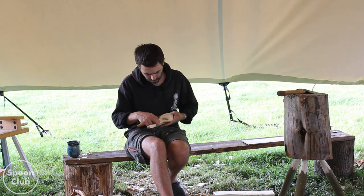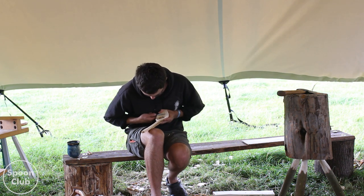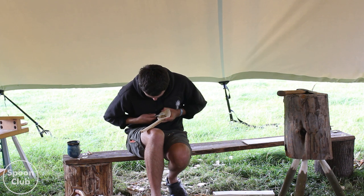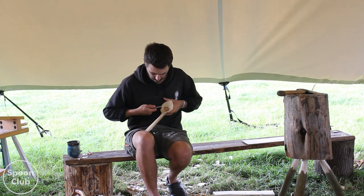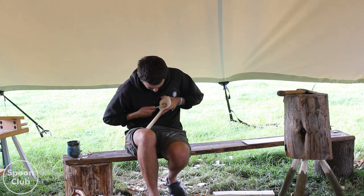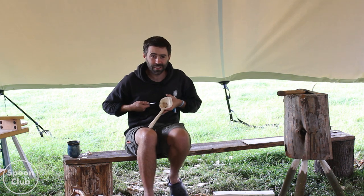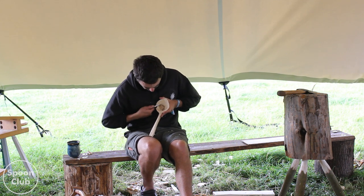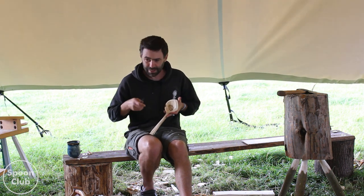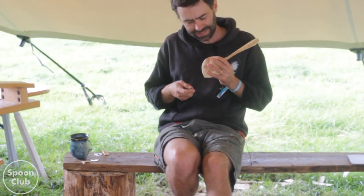It's a bit weird. I think I'm going to have to come down that way. The side of this ladle is going to include a knot. I'm pulling the knife through like I was doing with the axe - I'm really trying to slice as much as possible through this bit. What I don't want is for it to get caught and go clunk in, and then I've got a split that's right deep in.